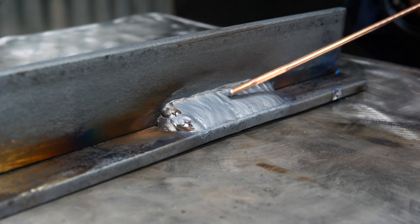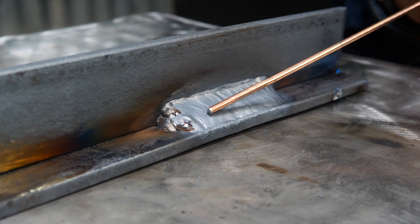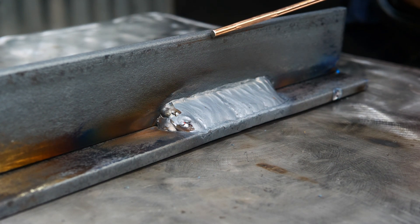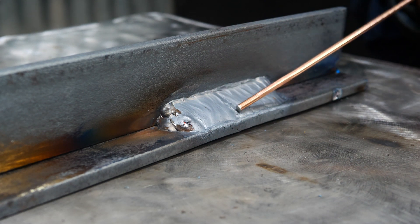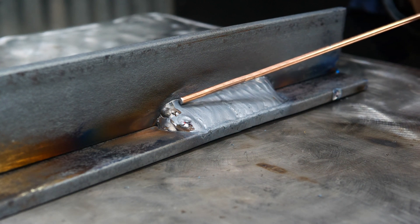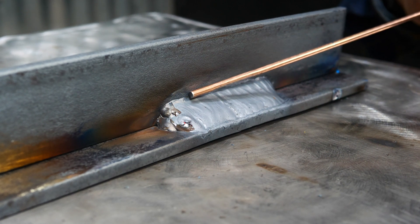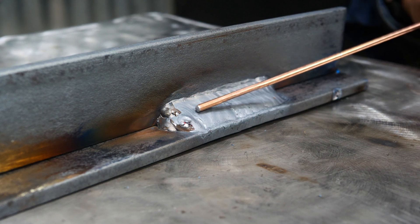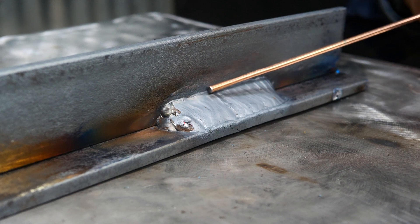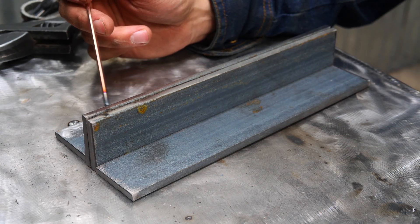Here's the inside corner joint that has way, way too much throat. It's a very strong weld, it's massive, but the big problem is we put so much heat into our quarter inch plate that we have a lot of warpage. When we're trying to fit this up against another part, it's not going to fit well because of the distortion. The other problem with too much weld is that in the heat affected zone we get large grain growth — the grains of the steel get very large and it becomes easy for them to slip or dislocate, creating a weak point right at the toe of the weld.